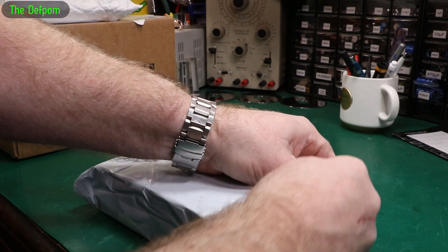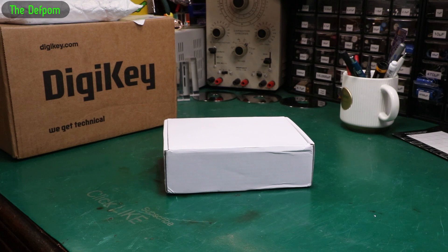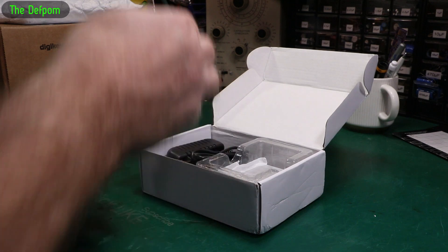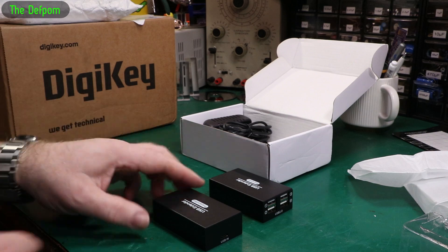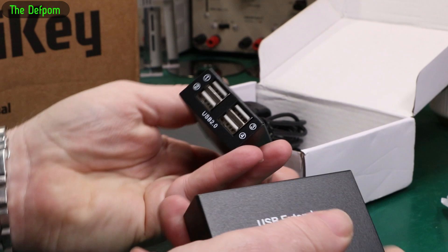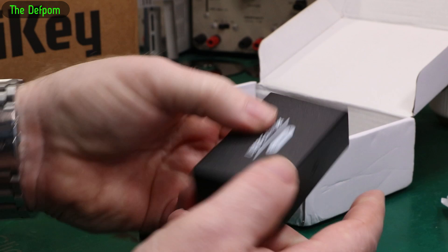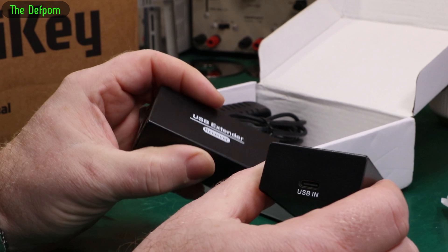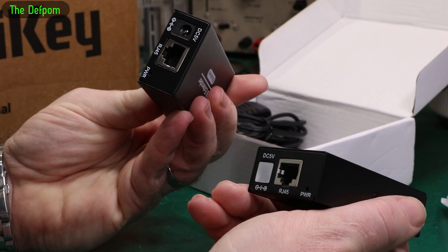Don't forget to have your links down below for things I can give you links for. So I was working on a project recently on my motorhome, and I needed some of these. What they are is a USB extender. That's a transmitter and that's a receiver. You plug a USB on this end and Ethernet on that end. And use an Ethernet cable to connect between your computer and your device. So if you want to plug a keyboard or a mouse in remotely, you can do that via an RJ45 port.